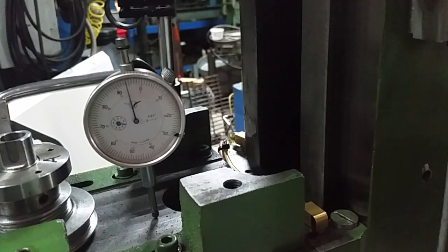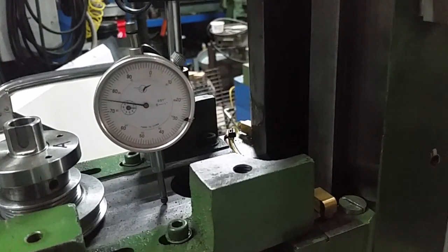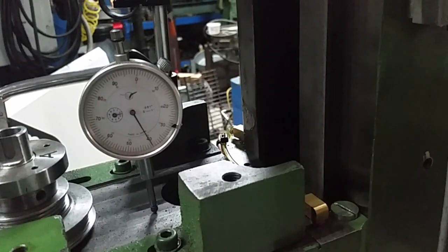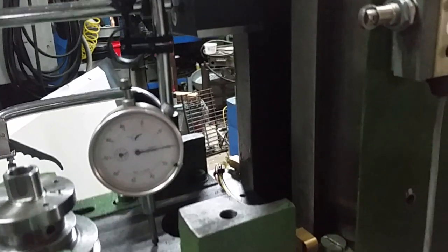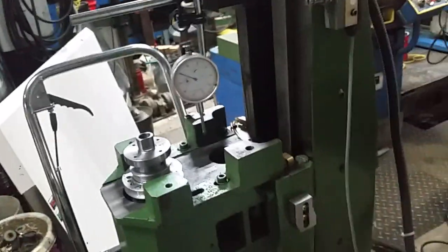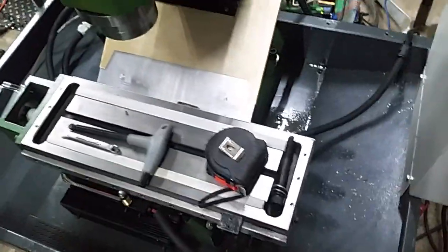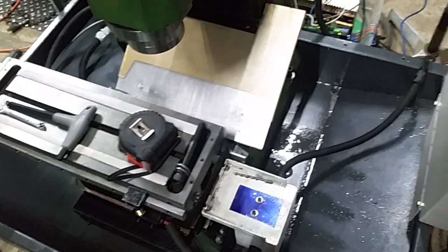I think my Z has about 1,000th of backlash. So there's 10 clicks. I can change the step size — to 5, 10, 20 — and now it jogs pretty quick. Soft limits are nice. I can go back to X and run it all the way to the end. I think for getting around the machine, the pendant would be fine.